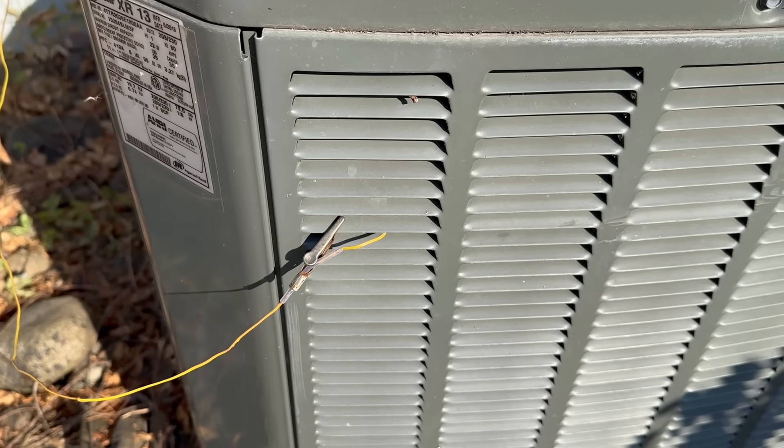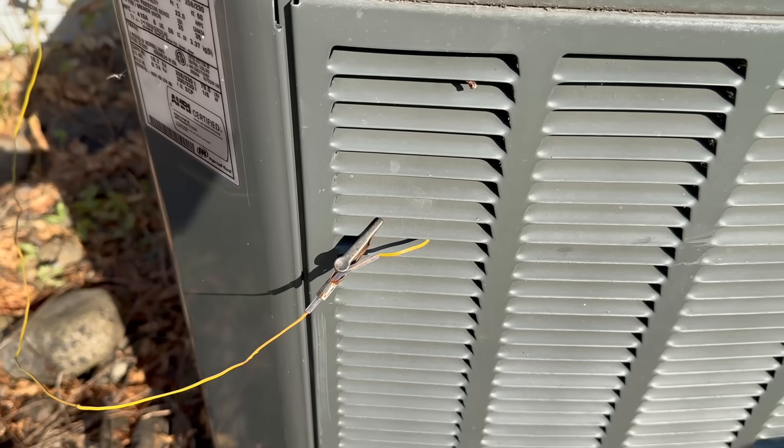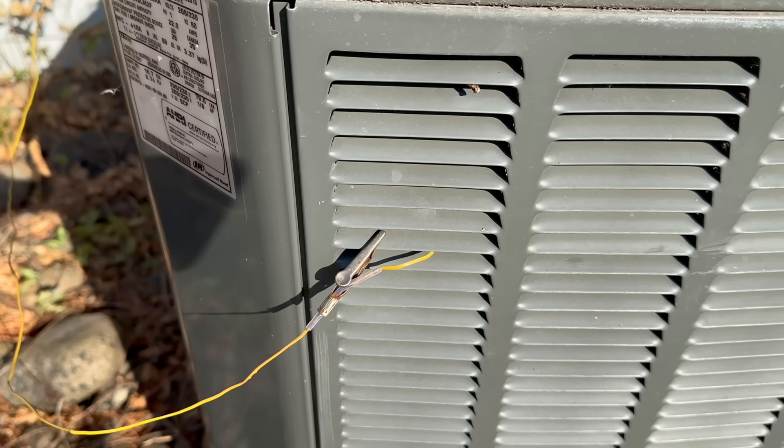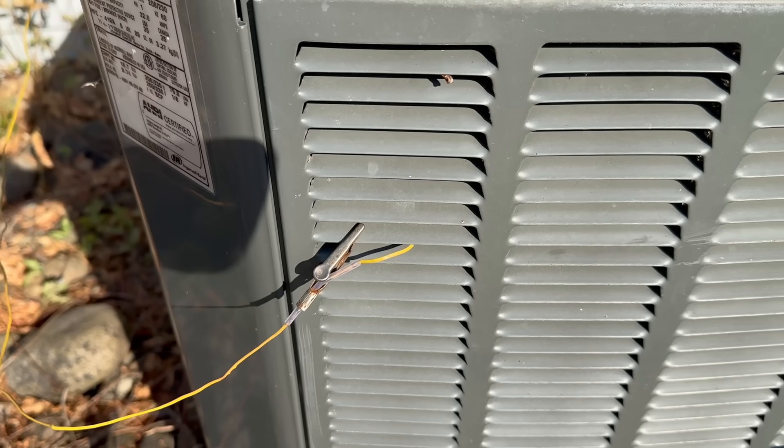I tried a little trick here. I took the same type of reading he's taken, but I put a temperature probe — an air temperature probe, not an infrared probe — and put it in the fins. It's going to read the air temperature moving across that coil. I've got a thermocouple probe in the louvers, not touching the louvers, not touching the coil. Let's see what happens when we fire this air conditioner up.